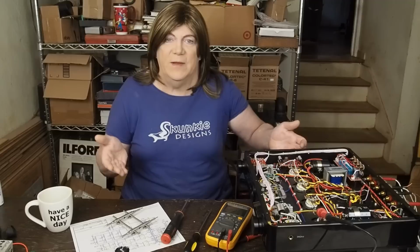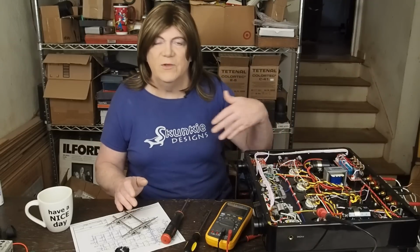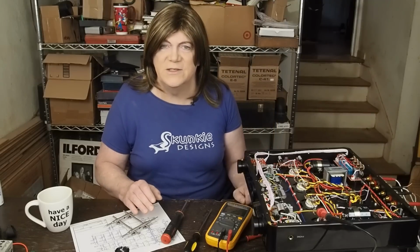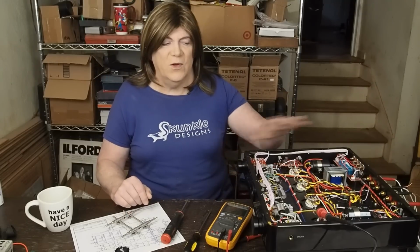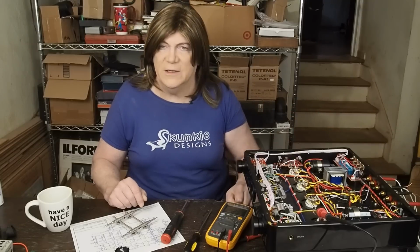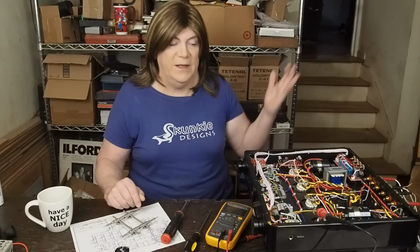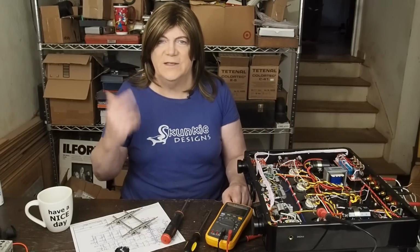You don't have to go out and buy new tubes right now. And honestly, now's probably a bad time to be buying tubes. So maybe live with what's in here or play with the front end tubes and just enjoy the KT88 tubes this thing comes with just as it is, and work on doing some of these inexpensive mods, replacing these resistors and electrolytic caps. Man, we're talking peanuts, really. It's less than $100 for the whole big order of everything. And even the coupling caps, going with some good ones, you're spending less than $100.